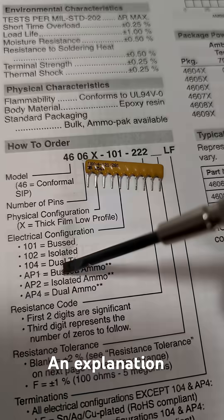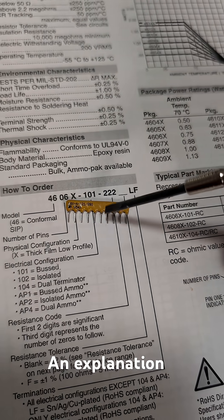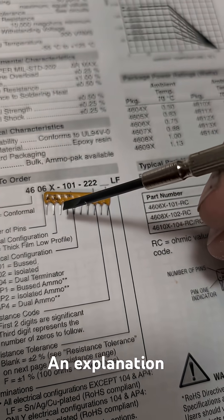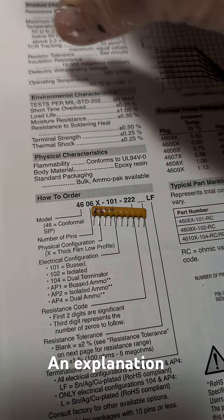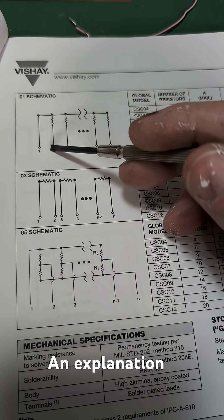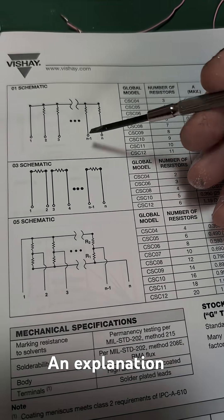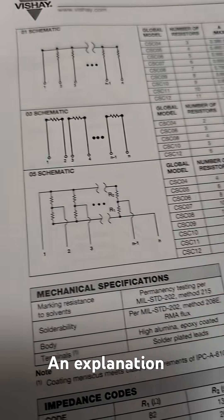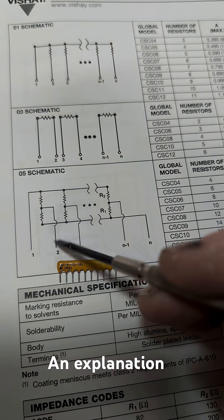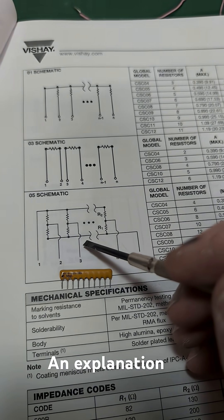So how come is that? Well, it's the dual terminator thing. And that's why, when I tested it, it didn't act like a regular isolated bunch of resistors, where each one of these posts would provide the same amount. It is because, here's a little diagram, that's what I was expecting. So, each one of these would provide the same amount of resistance. It's this that's contained inside here, or something like this. So, there's lots of little wires in here that are providing access to these resistor dividers, these voltage dividers.